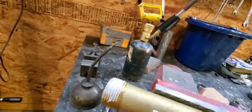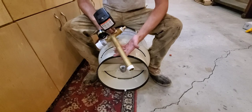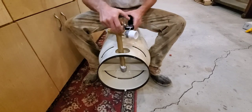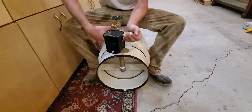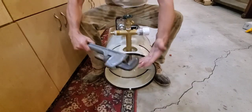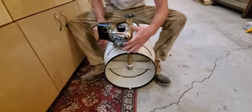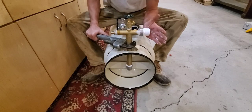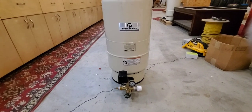On the base of the tank is a metal elbow with female threads. We're going to apply some liquid Teflon on the inside of there and do the same on the male threads of the control tee. Now all there is to do is assemble and mount the control tee to the bottom of the tank. I like to lay the tank sideways and sit on it, rotate the tee, get it as tight as you can by hand, then take your pipe wrench and do one revolution. Then use the bottom of the tank to square it up with the bottom of your tee.